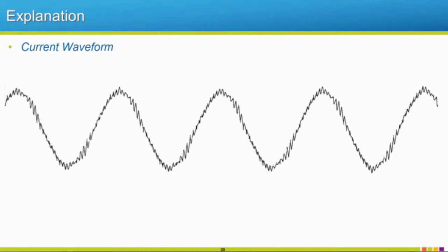You've got to remember, if you're switching these IGBTs a lot more often, what happens? Excess heat's going to happen. So these IGBTs are going to heat up quicker, and you may have to deal with a derate, especially if you're loading this up to its full capacity. There are built-in safeties that will protect the drive, but you're definitely firing those IGBTs more, which is going to create more heat. It makes a nicer waveform, but you've got to deal with that. A lot of your commercial applications like this higher carrier frequency because they don't like to hear the motor upstairs.